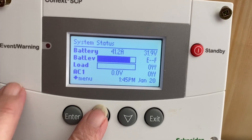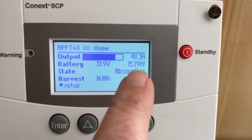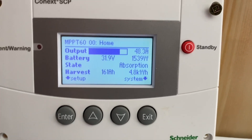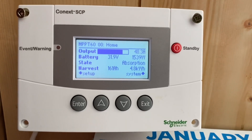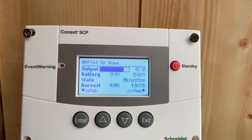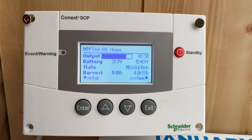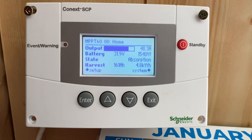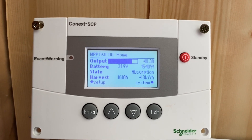For 45 minutes I have been equalizing the batteries, and you can see there's 1,539 watts coming in. It's a really nice day. To equalize the batteries — I had never heard of it before — inside your lead-acid batteries there are plates, and those plates, it's sort of like a tea kettle: they get all that calcium or whatever on them, they get all gummed up. So you equalize them, and what equalizing does is more or less burn that off.